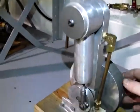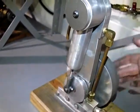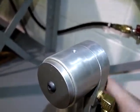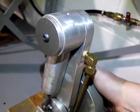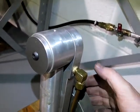It's very simple. The unique thing about this is, as this is rotating around here and the cylinder is rocking, the base of the cylinder housing is its own valve. There's a very small hole inside on this side that when this swings over, it opens up, powers it down, and then opens up to an exhaust hole.